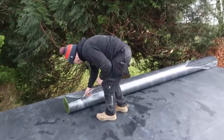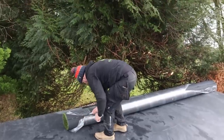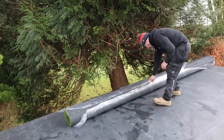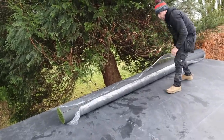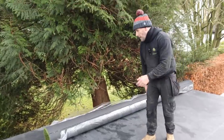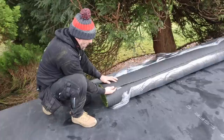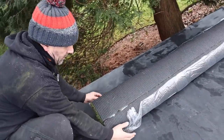So what we're going to do on this one — and it's the first time we've done it — is put astroturf on the roof. No other reason apart from it looking aesthetically pleasing. Also, for those who've asked about cats clawing or squirrels damaging your rubber roof, this could be the answer — it's got an extremely thick rubber back, it's porous so it lets water through onto the roof, and it will extend the roof life considerably because there's no direct sun on it.